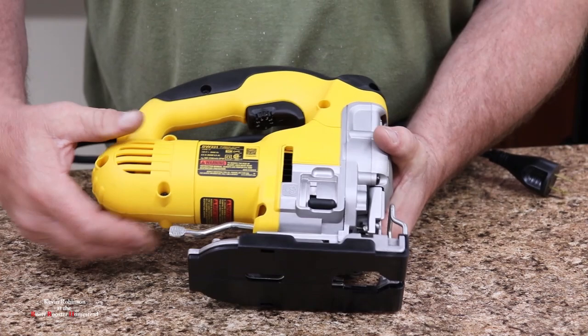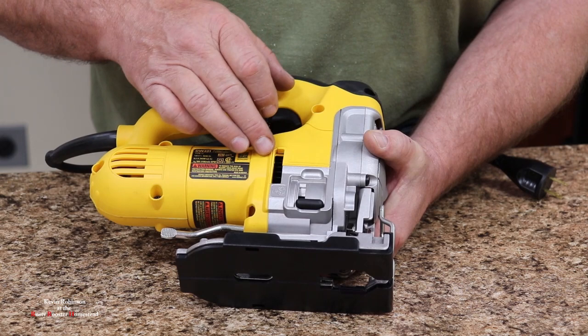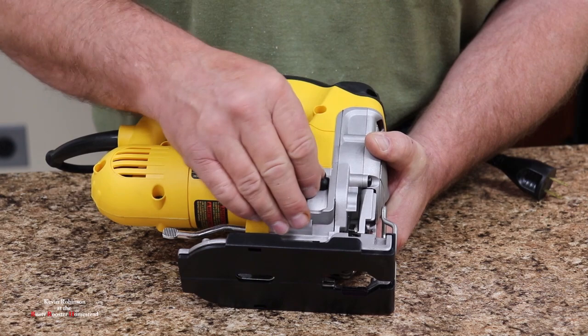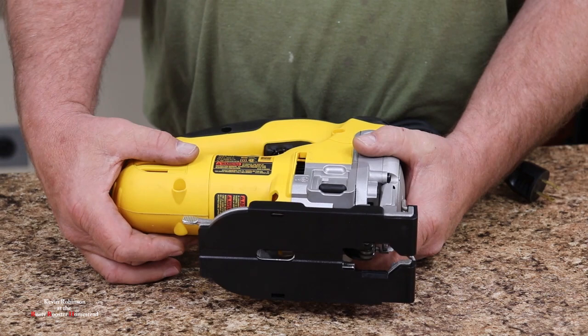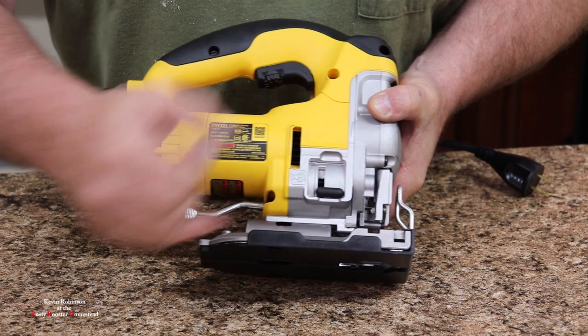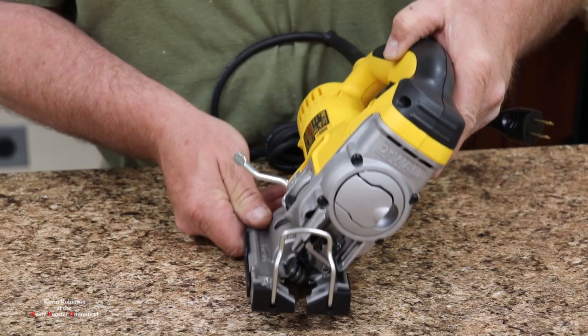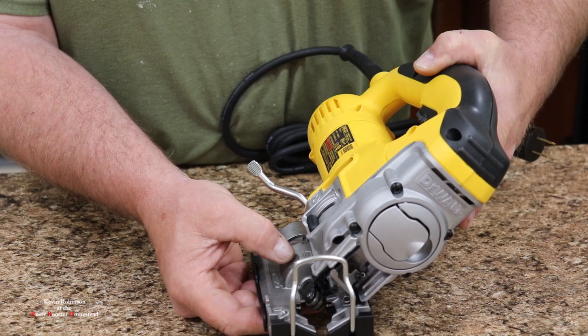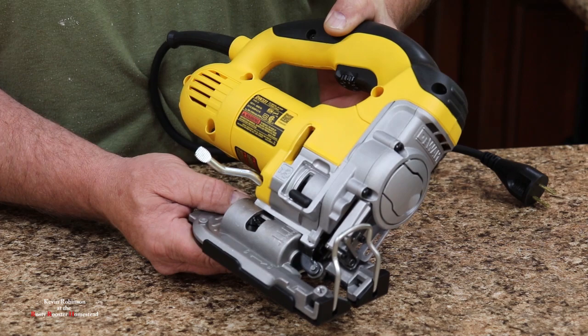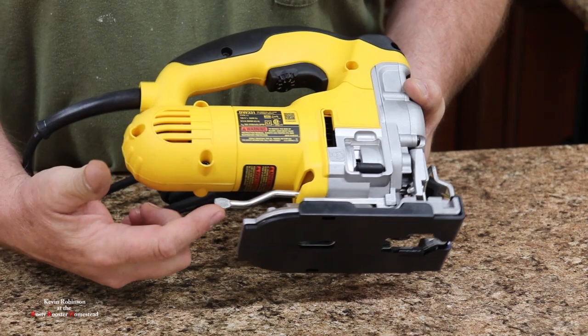On this side of the machine you'll see a little arrow that looks like a cloud — that's for air, to blow the dust away from your work piece. You can go from low to high on that or anywhere in between. This saw also does bevel cuts at different angles. There's a lever on the side — flip it over, push it up, and you can turn the body to cut at 15, 30, or 45 degrees. When you come back to your 90-degree mark, pull it back in the slot and lock it with the locking lever.